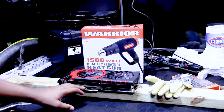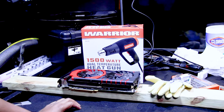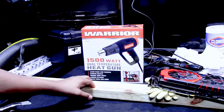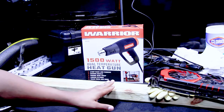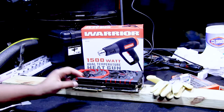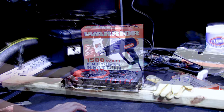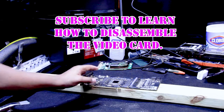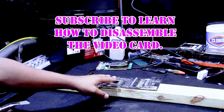What I'm going to do is break this down back to the motherboard and then we'll get started on the process. I have it on this two-by-four, because when we're heating the motherboard it's going to get pretty hot — all that heat will penetrate into the wood, not the table or cloth or anything like that. We got all the hardware off and our GPU cleaned up from the thermal paste.